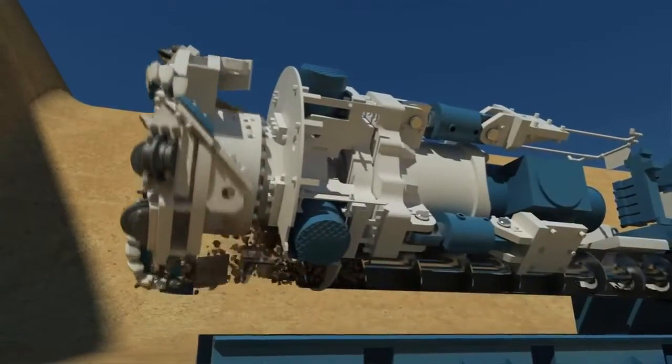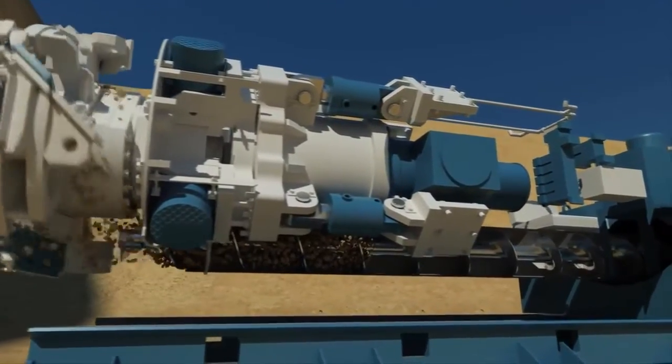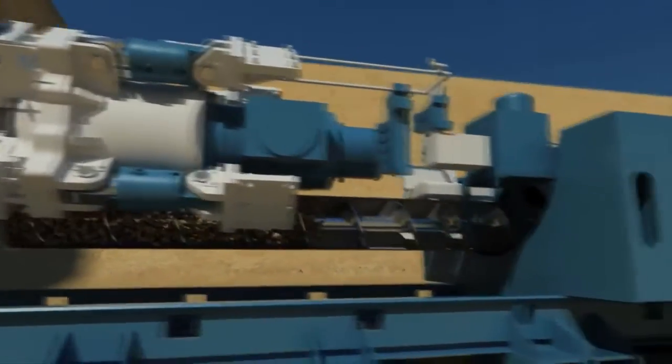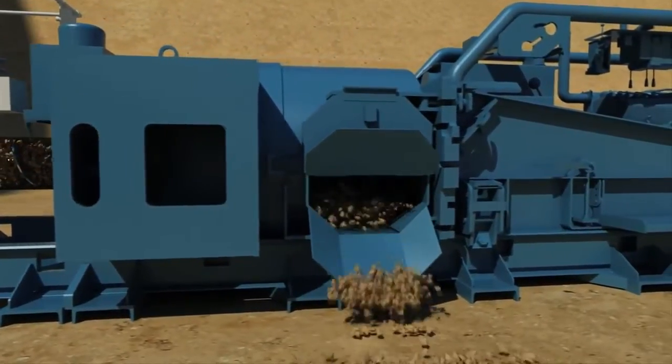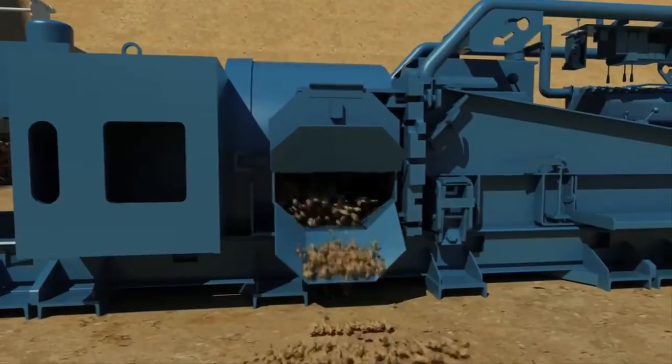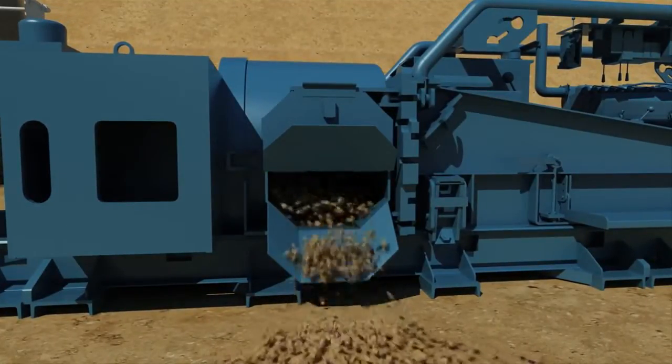Spoils are transferred from the cutter head into an invert auger that runs through the length of the casing. Muck is emptied from a door in the ABM's master pusher. From there, the spoils are removed using a muck skip and crane or muck cars. In diameters below 48 inches or 1.2 meters, spoil is removed using a vacuum line.